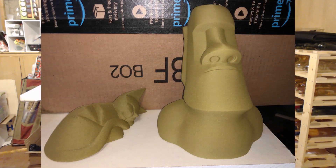Recently I got it in my head — well, I've got a better printer set up now on my Ender, let's try it again. The prints came out great. But after taking the filament out and putting regular PLA back in, same thing happened. The filled filament backed up in the stock hotend and I have a completely ruined hotend. So tonight I'm going to take you through changing the hotend on a Creality product.